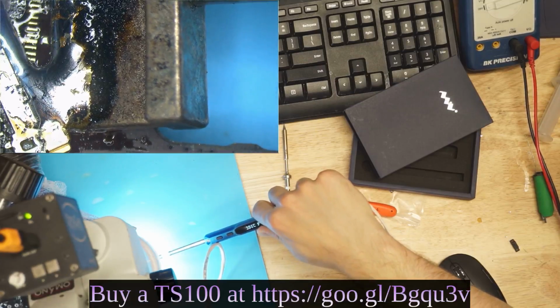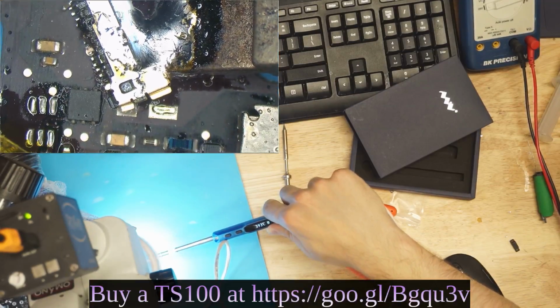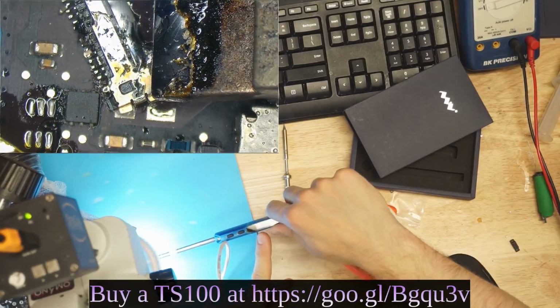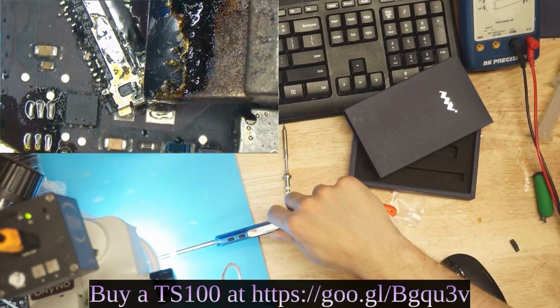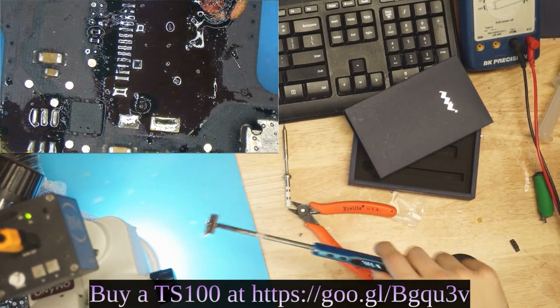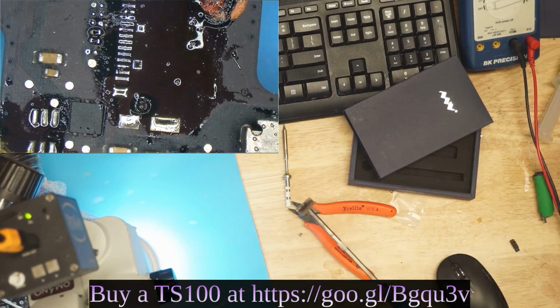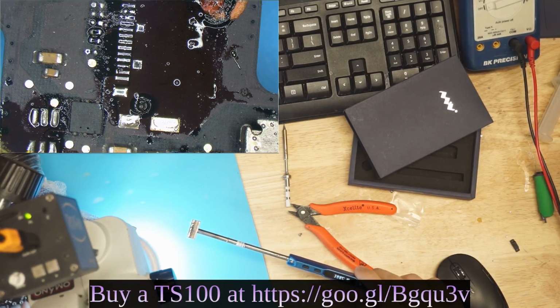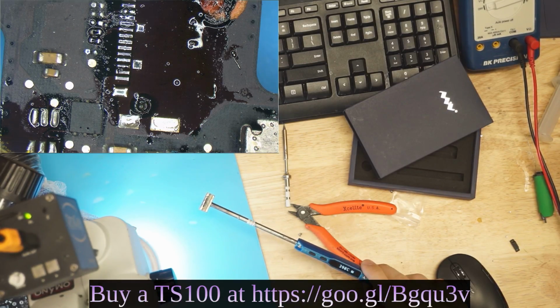And now we're up to 2.7 amps, and it was able to knock that LCD connector straight off the board. So the temperature spiked. It's able to maintain a temperature of 390, and that LCD connector doesn't know it hit it. It's right off the board. So it does have the capability to work at 12 volts. It's just you're not going to get optimal output without 24.